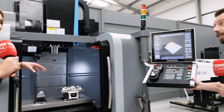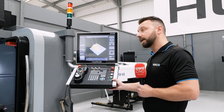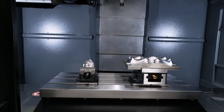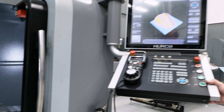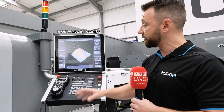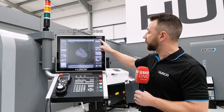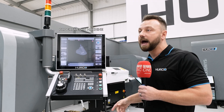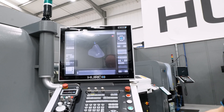That's a really compact machine. This part here — how was that programmed? Using a particular option called solid model import, we can bring a STEP file straight to the machine. That particular part on the left was programmed at the machine using that STEP file that you can see just there. We have the ability to pick surfaces from it and converse with the machine using that particular option.